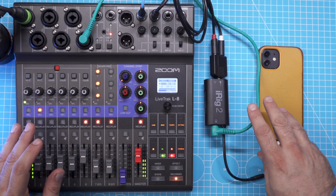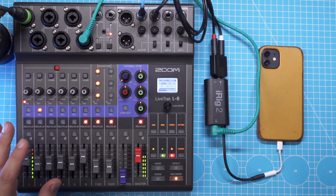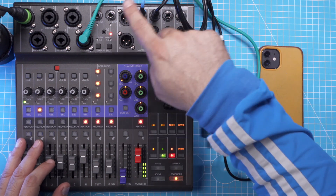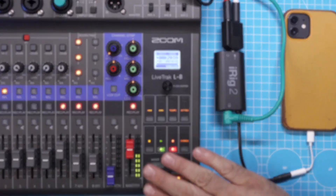So now we have our phone signal going into the mixer, and from there the mixer sound is going back to the phone through mix A. Now we need to decide what should go out in mix A — what we want here is to create the mix-minus as the fourth and final step. In other words, let's send back the entire mix into the phone minus the phone's sound itself, to avoid an endless feedback loop where the phone sends sound into the mixer, which sends it back into the phone, and so on.